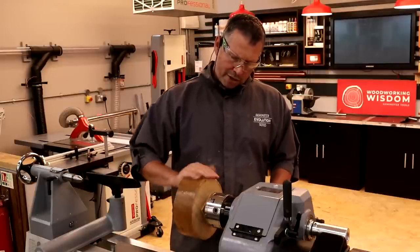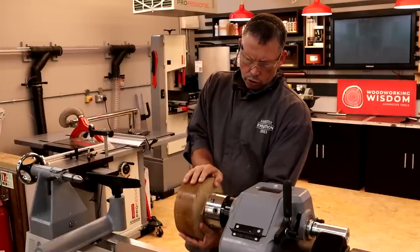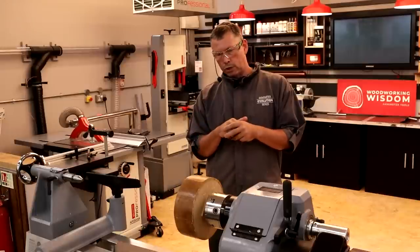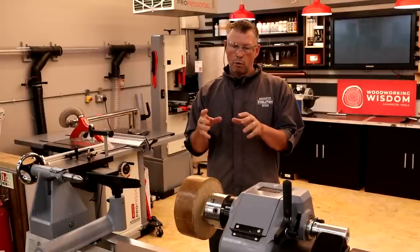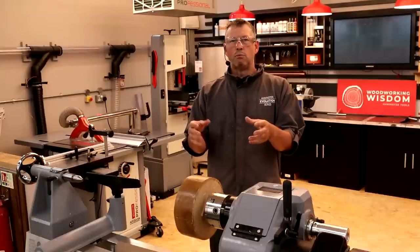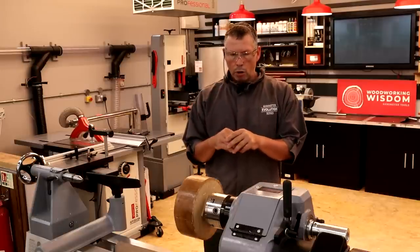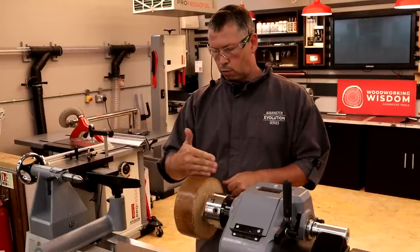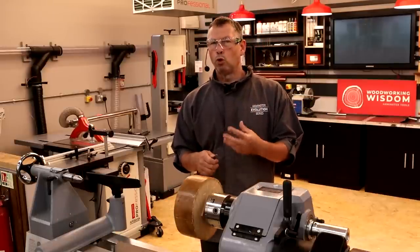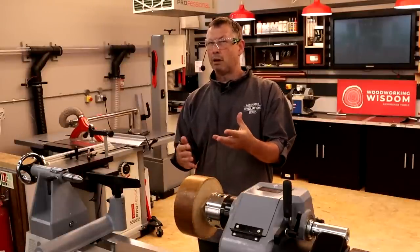It's a little bit of oak. I think there's a little bit of moisture left in this — it's not sold as wet, but I think it may be air dried, not as dry as a kiln dried board. Every bowl, regardless of its state, will move a little bit, and that tension can spring. This being with a little bit of moisture might move a little bit more. But looking at the grain direction, this is going to be probably more stable than other blanks. The best thing to do would normally be to rough turn it and just leave it a month or so.